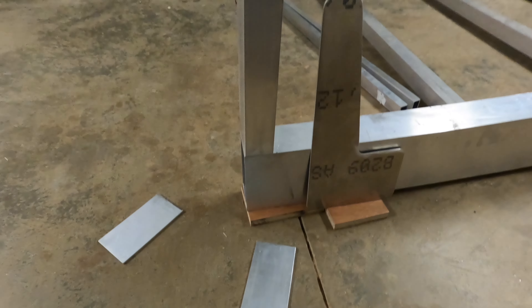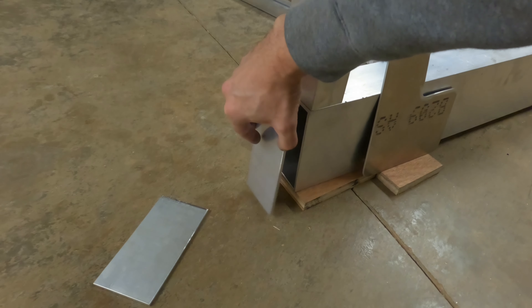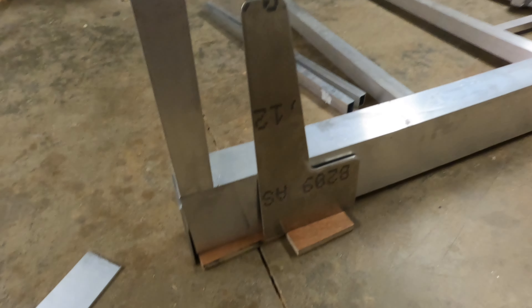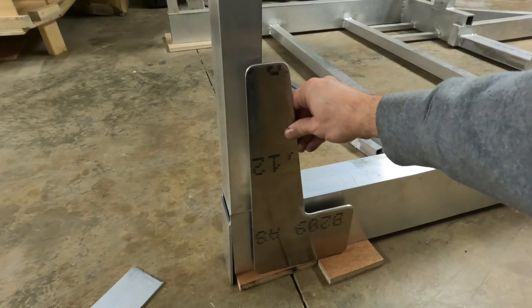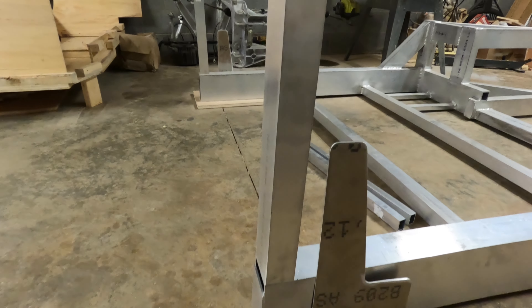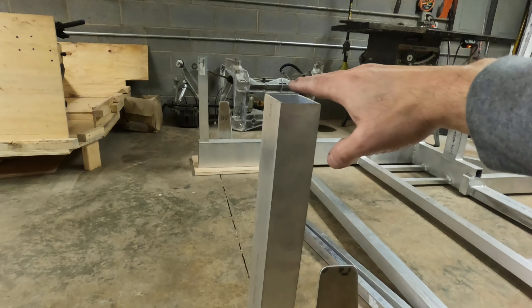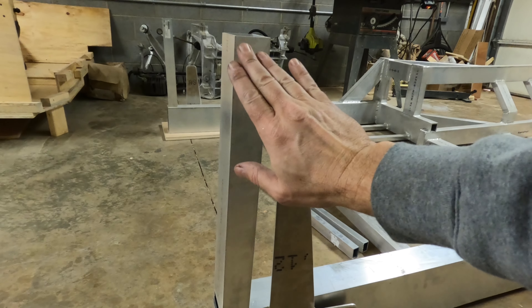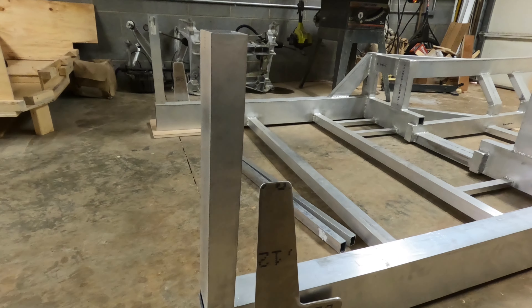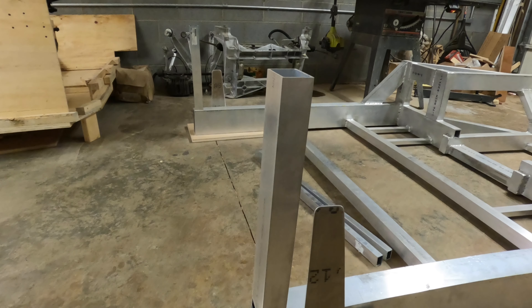Just finished making some of our plates here. I have got these two end plates that will cap off the ends of the tubes, and I have made the two splice plates. These will weld on and go over the outside joint of these two tubes just for strength. This vertical tube needs to be as strong as possible — it is where the front end ties onto the car and where the roll cage attaches to the top of this vertical tube. Most likely the door will also be hinged onto this tube somewhere, though it is possible another tube will be added depending on where the door hinge ends up.